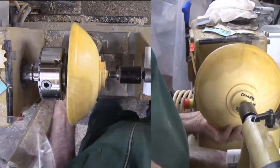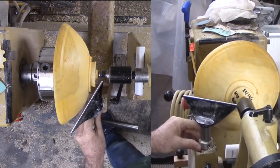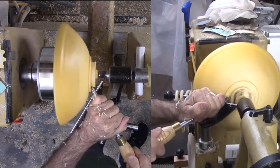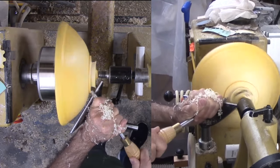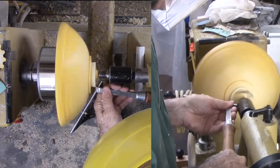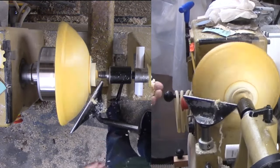For this mount, the chuck jaws are closed. The bowl is pressed against the chuck with the live center. Yes, this may damage the interior, but I still need to tool the inside anyway, so not a problem. The original live center divot provides a center mark for this mount — I really hate it when I have cut it away. Job number one: refine the tenon to make it run true again. A spindle gouge and skew makes short work of this.